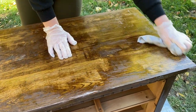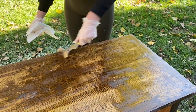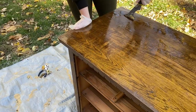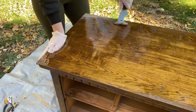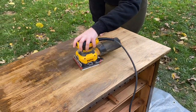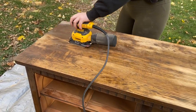If I were to go back and do it again, I honestly probably would have just sanded from the start. I knew I'd have to sand even after stripping, but not as much as I did. In hindsight it felt like a lot more work than it had to be. For sanding, I first went in with an 80-grit to get all of it off, then 120-grit, and lastly a 220-grit to get that smooth finish I wanted.